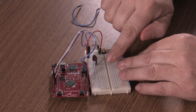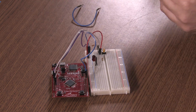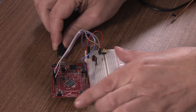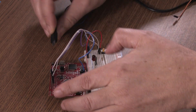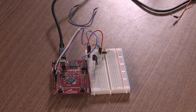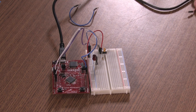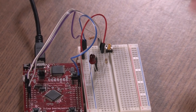So PD3 through the resistor to the LED to ground. One more cable is the power cable, so we've got to plug that right in here and this will plug into the PC. We'll switch back and show it to you from the compiler stage, but our hardware is all built.